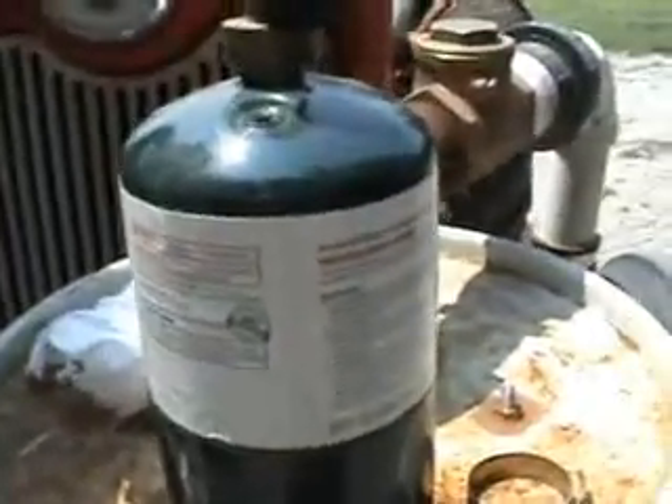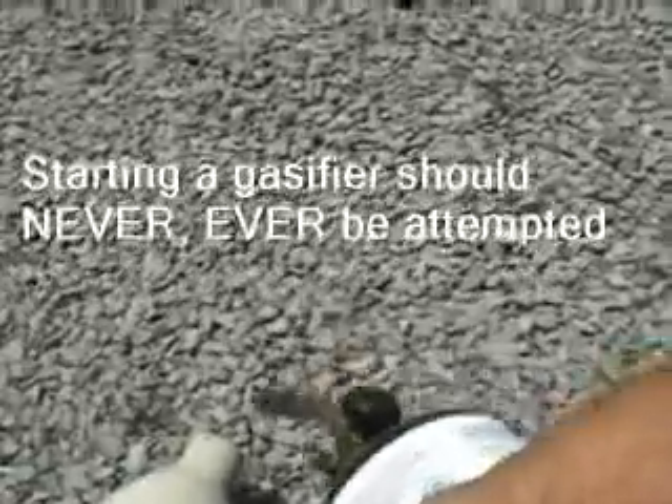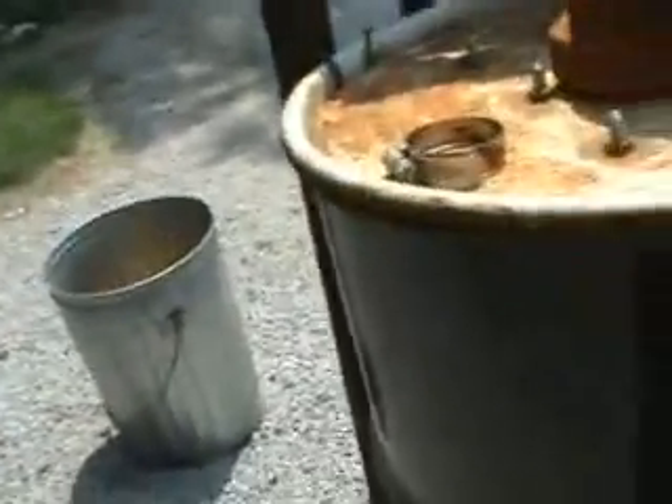We're still running. She's cooking now. I can test my flare — I don't really worry about lighting it at this point, I go by sound. I'm getting a little bit of a roar. There's absolutely no smoke at all because everything is filthy. The louder the roar gets, the stronger the gas is. That'll probably start it right there. Turn the blower off, shut this valve. As you can see, we've got some smoke coming out because there's no air being pumped through the system — just a little puff, but things are still hot, which is important.